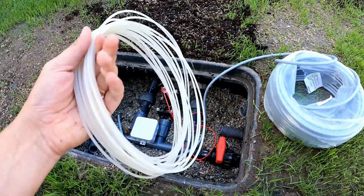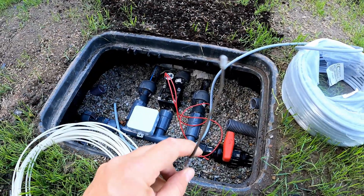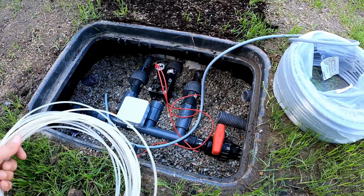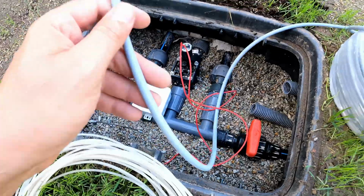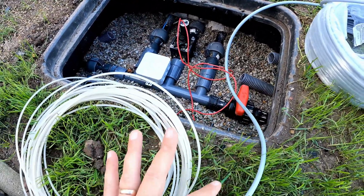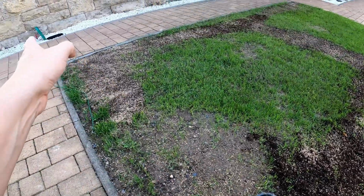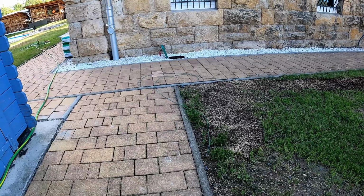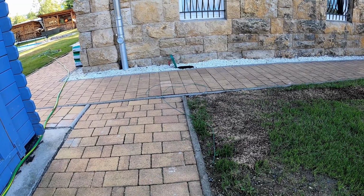I have a simple cable puller from the hardware store. The end with the search head is inserted into the empty conduit. With its flexible tip, the cable puller finds the right path. On the other side, I can attach the cable. For this, I will strip the insulation from the cable, open it up and expose the wires. Then I can use the cable puller to pull the cable through the empty conduit into my first small distribution box. From there it continues onto the other box near my water connection. From there I pull the cable through the house wall to my irrigation computer.